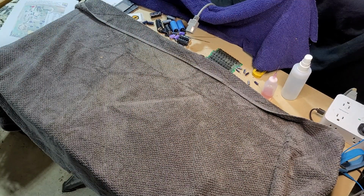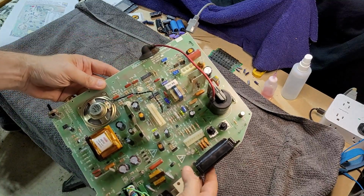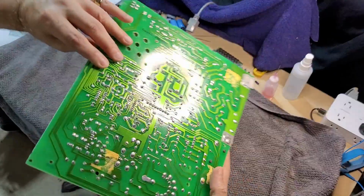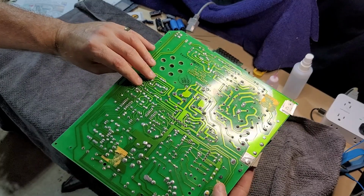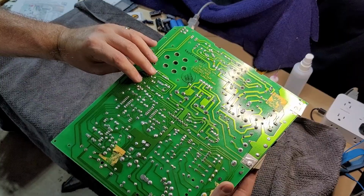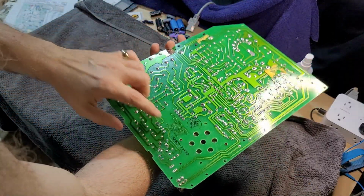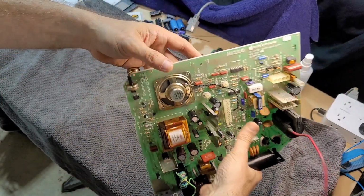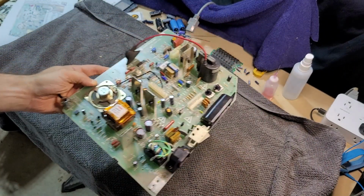All right, I've got the analog board, as you can see, completely recapped. That went fairly well. These single-sided boards are often really nice to desolder, just because solder is often difficult to remove when it goes through the through holes and etc. Let's see, this is a 8384 branded analog board, if that matters to anybody. Yeah, so let's get the machine put back together.